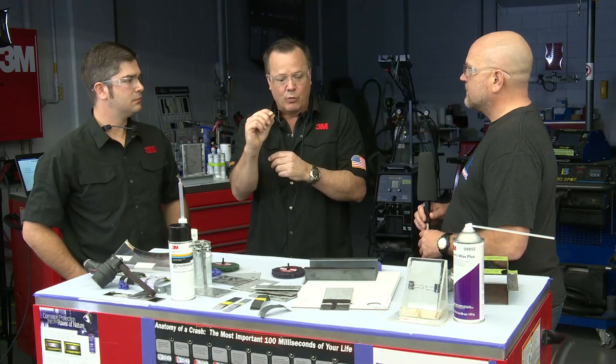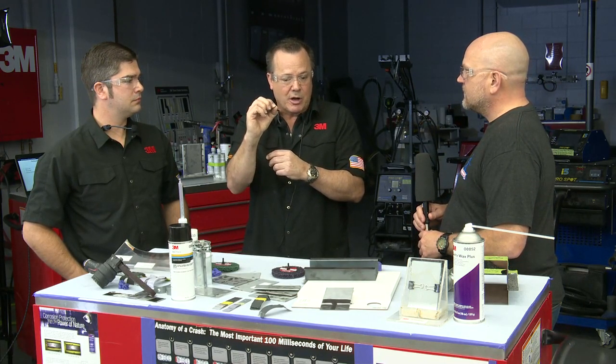You get much better conductivity, and it forces that adhesive out of the way when the welder tips come together, whereas if it's cured, it doesn't do that. Sure, it's trying to push that current right through the adhesive, so you get some blowout and stuff like that. Exactly.